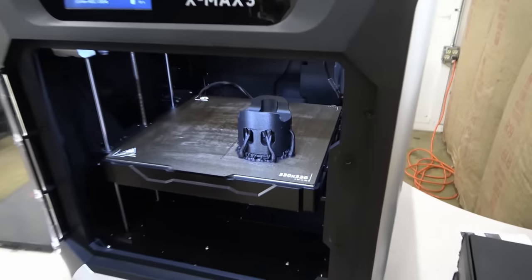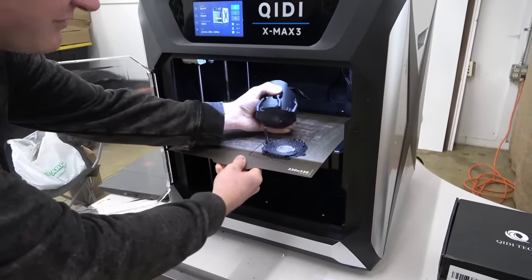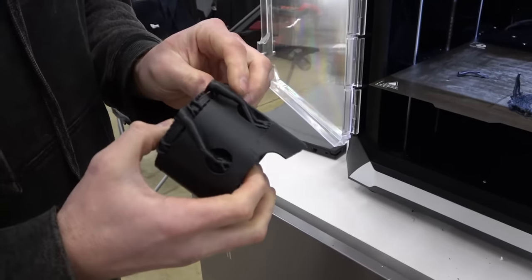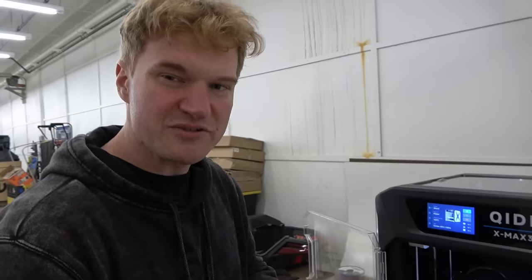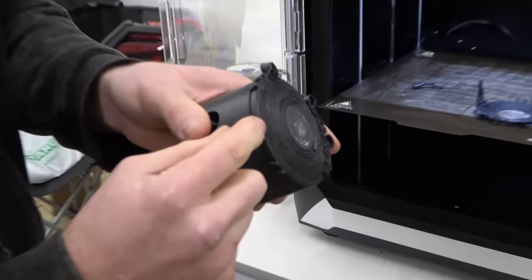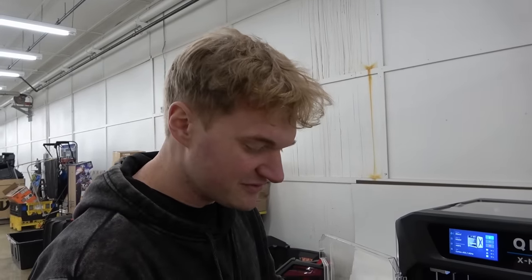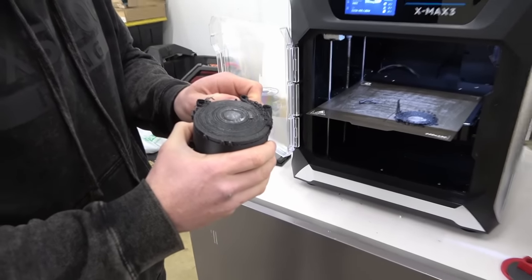And there it is — the final product, hopefully. I rushed a little and never completely dried the filament out perfectly, but it made it through the print. A couple of differences: after we measured the squish — the distance from the top of the piston to the head — it was way too big, so I added 30 thousandths to the top of the dome. I opened up the ring gap a little because I was worried it was pinching the ring and not allowing it to seal on the cylinder. And I made the diameter just a little bit bigger. Hopefully we get some better compression out of this one.